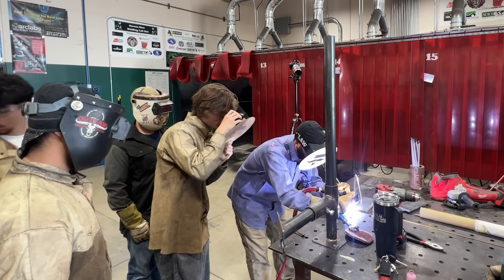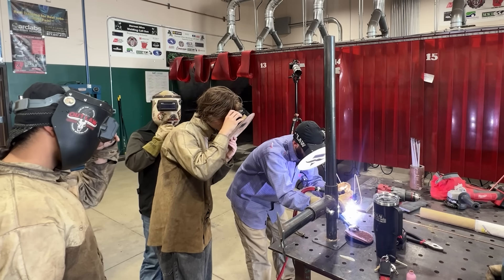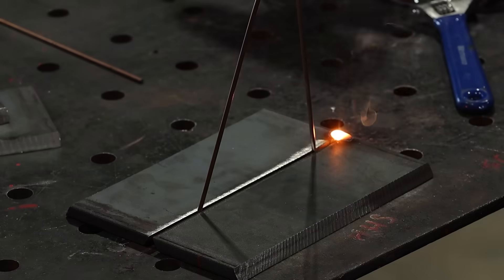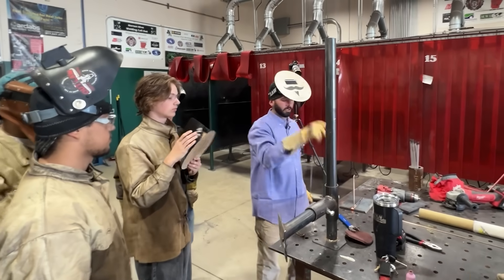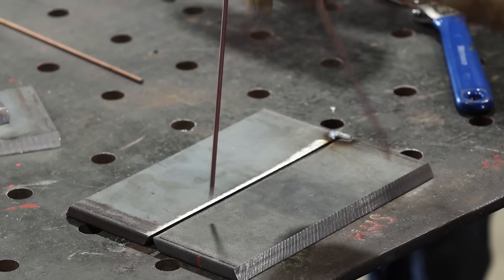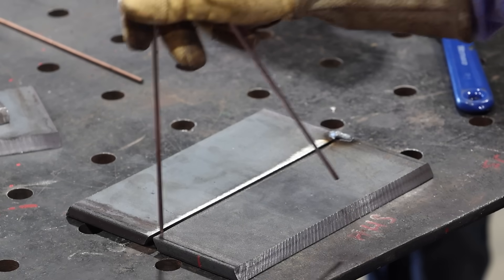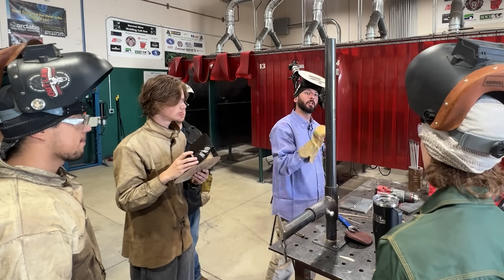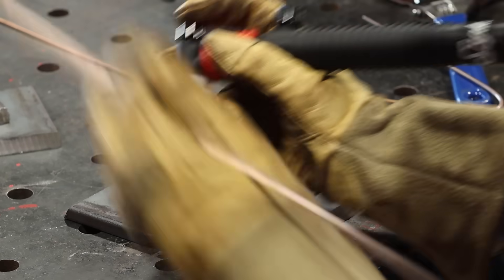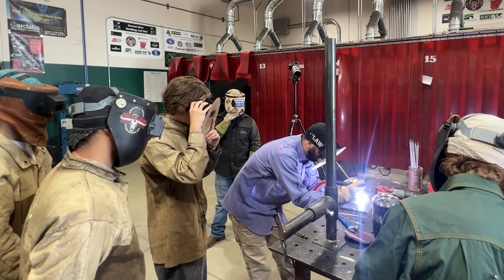Get a puddle on one corner, put a nice little daub of metal, then come over to the other plate, get a puddle, put a daub over there, come back and bridge it across — work that torch over, make sure that tack is fused and solid. You can see the gap is a little tighter toward the tack side — that happens every single time. I want it a little wider because by the time I work from bottom to top it'll shrink. So I'll give it just a skosh more wiggle room, then tack the same way.